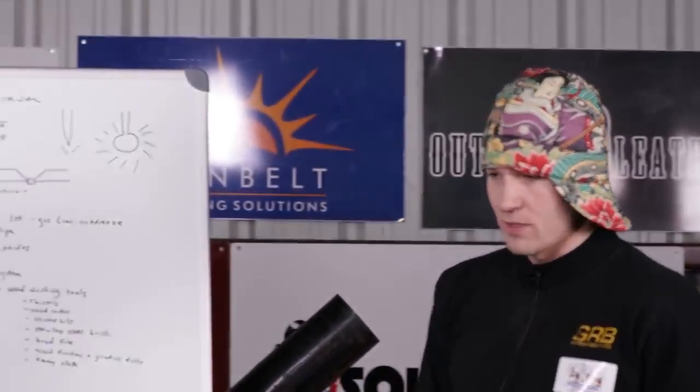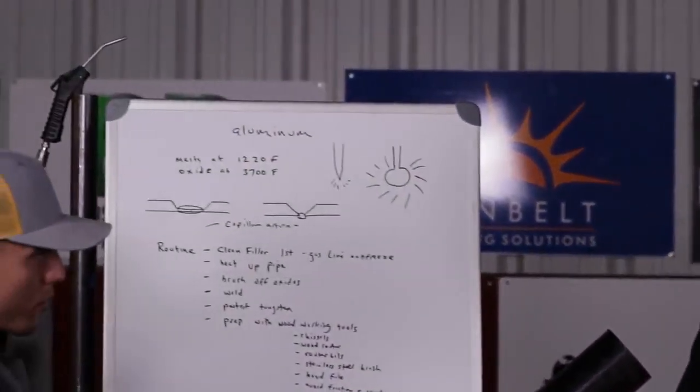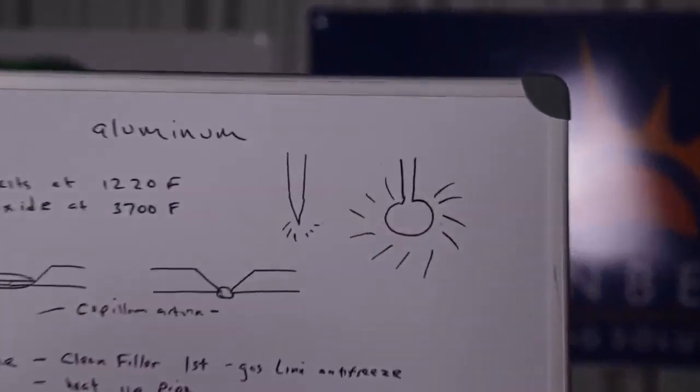And also the kind of tungsten. I believe there's a manifold manufacturer on YouTube that has videos where he's tried different tungstens with different etching, and he's had different weld results with each tungsten and how they hold up at elevated temperatures. I've also found that 2% thoriated seems to crack in the middle when you have it at elevated temperatures.